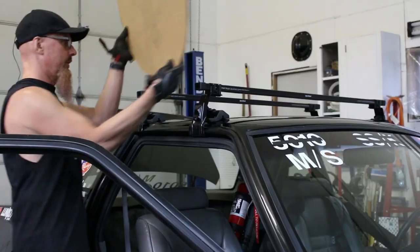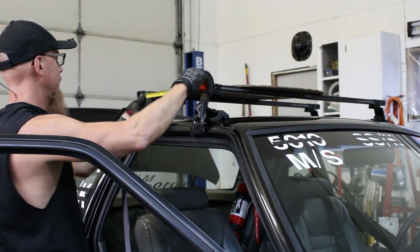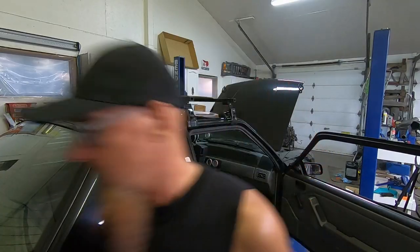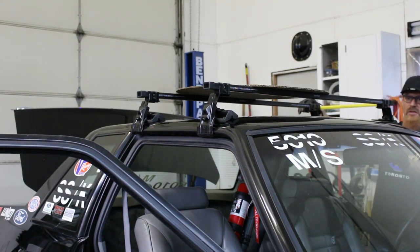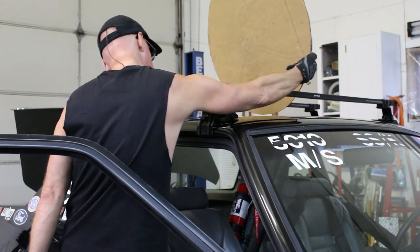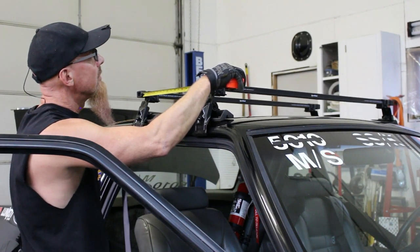One lightweight analog for a 26-inch tire. I might want to try and go about another inch. Let's go to 16. Let's try 17 — looks like we're still in a decently flat section. 17 looks pretty good. Let's see how our tire likes that. That's getting about as close to the roof as I want to get — actually, that's a little bit too close. We'll go back to 16 and build it based on that spacing.